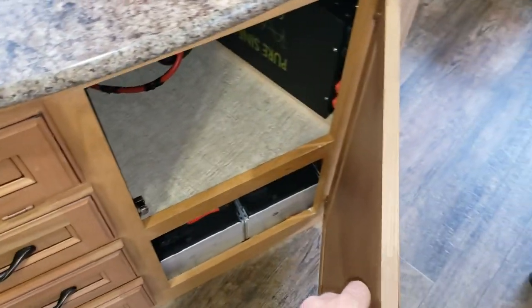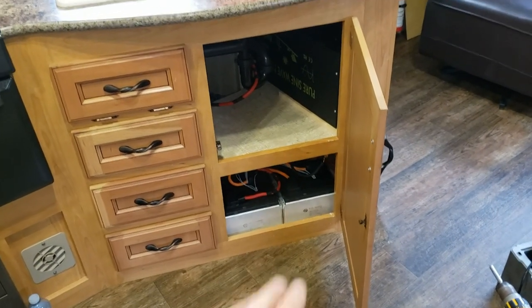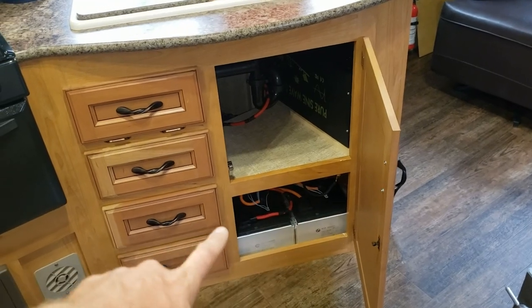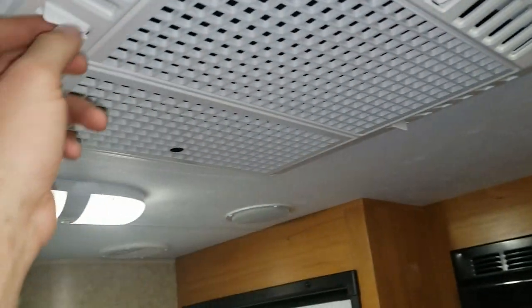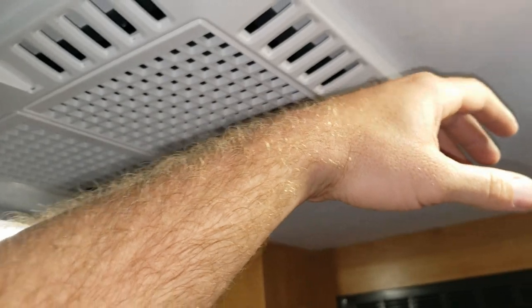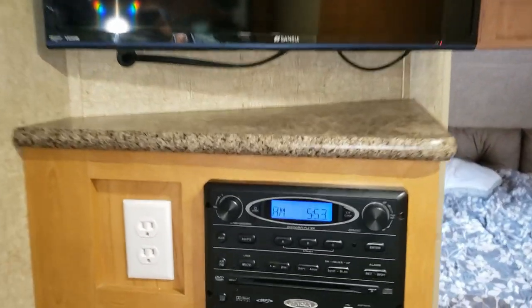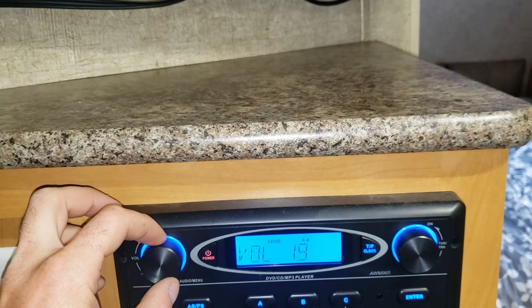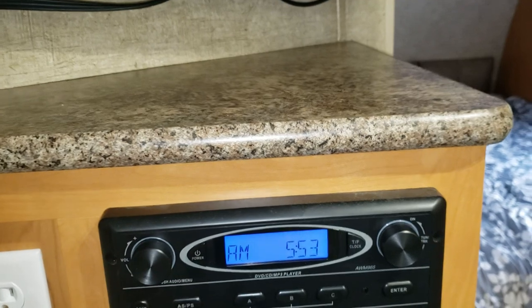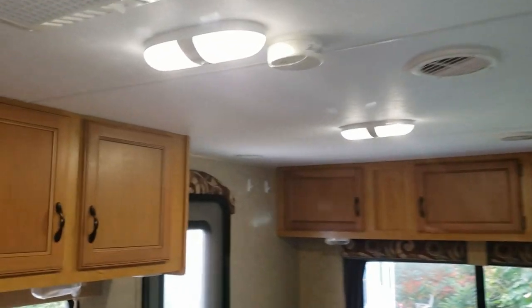This is just a backfed test — not even properly hooked up yet. These are the BMW batteries I took apart from batteryhookup.com, just one string of 16S batteries, and it's working really nicely. Opening the vents up for more cooling — it's definitely cooling well. Turning the radio on to check for any weird frequency interference — nope, nothing. It's working great.